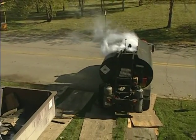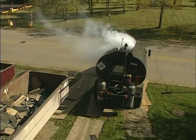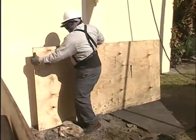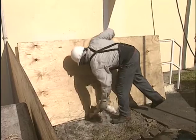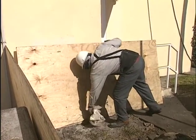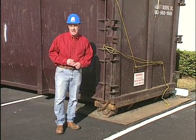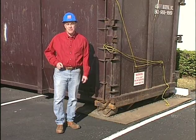Bitumen spills or falling debris can damage sidewalks, driveways, landscaping, walls, and windows. Sweeping dirty water off a roof can also stain exterior walls. Protect all work areas with tarps or plywood. Before dump trucks and dumpsters can be brought in, protect soft ground using plywood sheets or wood planks. And avoid driving over sidewalks. They're not strong enough to support the heavy loads.